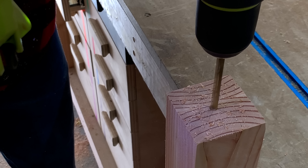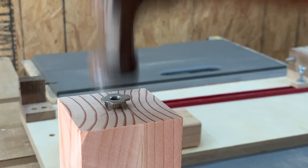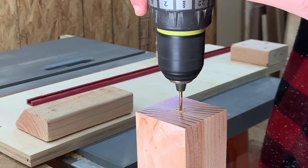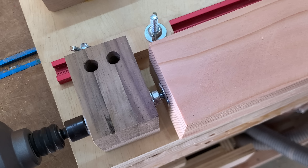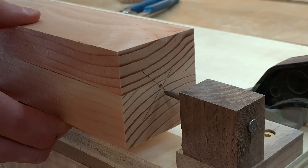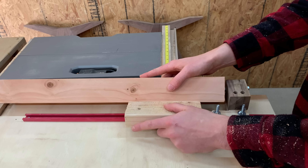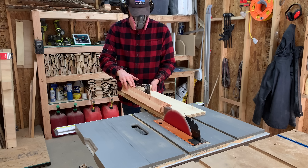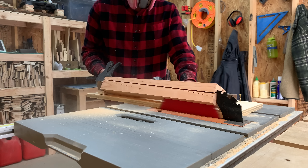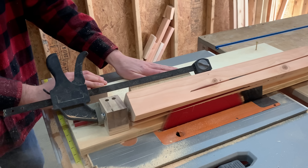The top of the leg blank needs a 3/8-inch hole to accommodate a quarter-20 T-nut that gets hammered in. The bottom of the leg just needs a 1/8-inch hole. The leg then gets threaded onto the headstock and the retaining nut is tightened down, then just slide the headstock down until the bottom of the leg sits firmly into the tailstock. To make this turning process safer, I inserted a wedge under the leg to hold it as I cut off the bulk of the waste. I have a full video showing a more detailed process of how this jig works linked in the description, so check that out if you're more of a detail person.